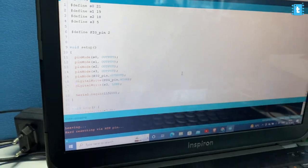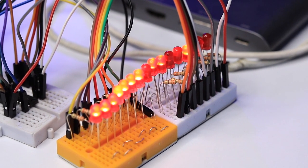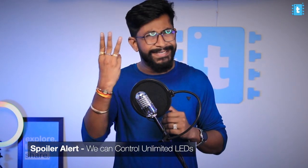Here I have uploaded a sample sketch to glow all the LEDs connected to the MUX-DMUX module. But as you can see, the LEDs are flickering. Using this module, we will be able to control only one pin at a time, and if you want to control all the pins simultaneously, we won't be able to do that. There will be a delay in between, so we'll observe a flickering effect and relay triggering issues.